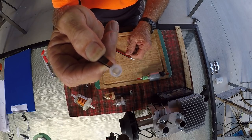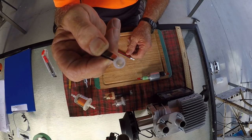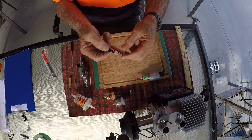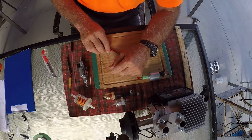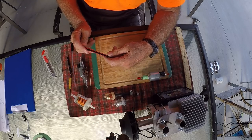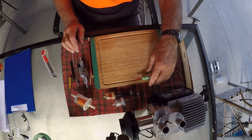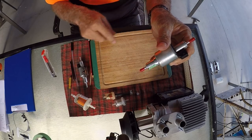Now, all I can say is you people in Germany don't appreciate what wonderful quality diesel you have. If you can run diesel that is so pure that all you need is a filter like this, then you have excellent diesel. For the rest of the world, we get crud in our diesel, particularly in the marine field. And the first thing you need to do, if you've got one of these in a boat, and on the Eberspacher, is unscrew the bottom and the filter comes in here.